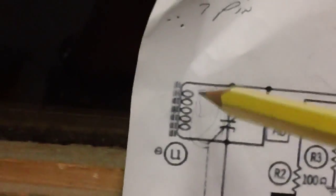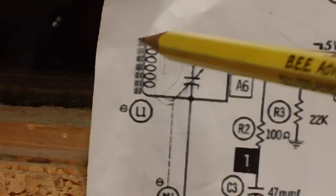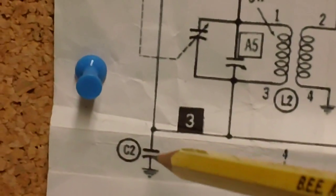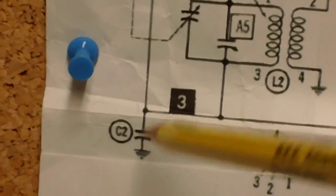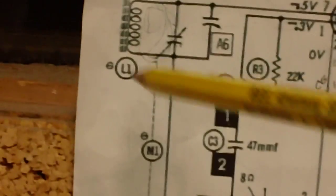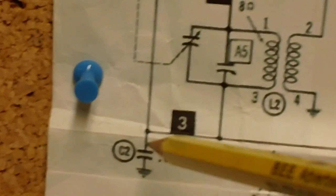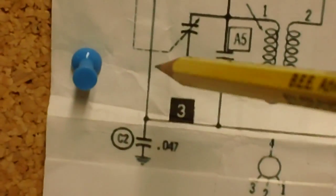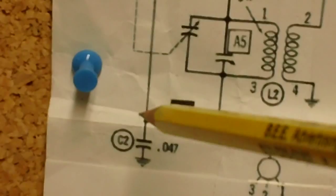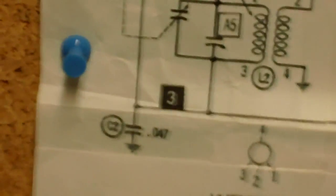We're dealing with thousands of cycles of radio frequency. And once it comes in, it gets the tank oscillating. Again, it's a high frequency. This particular capacitor was chosen to allow those high frequencies to go on through the ground. And that's how they're able to establish the RF return path to ground, because the RF at that high frequency, or the carrier frequency, is what we're talking about here, goes through that capacitor to ground as if the capacitor was not even there.